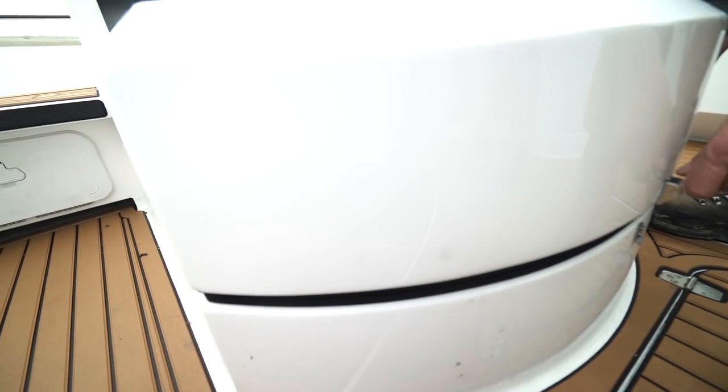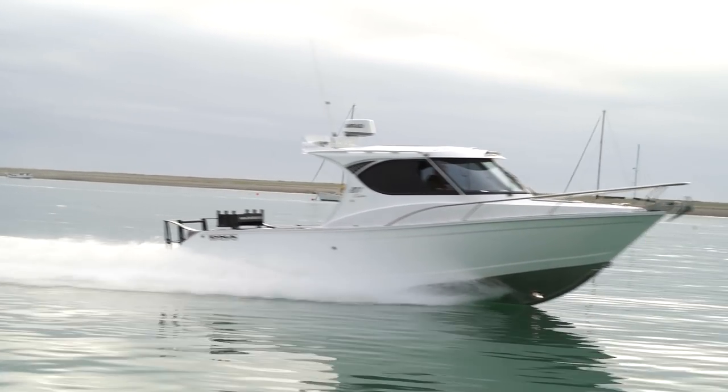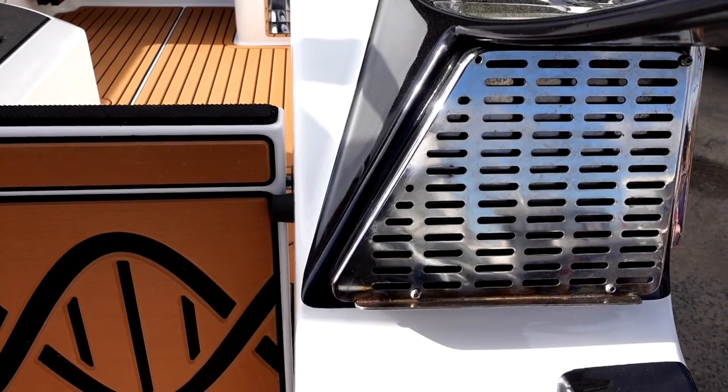It's braked on one axle and has in-cab controlled braking. The powerhouse in this beast is a VW 260 TDI V6 diesel engine — it's got plenty of punch. Pushing it along is a Mercury Bravo 3 Duoprop stern leg. Cooling the engine are three intakes on top of the engine cover, with exhaust aft blowing hot air out the back through stainless grills.